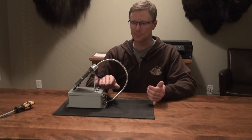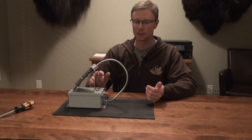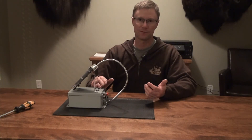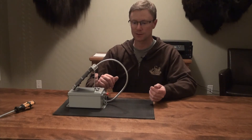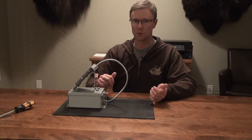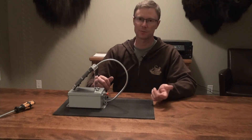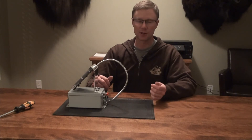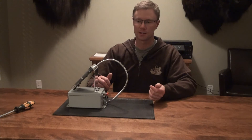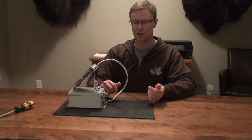In this homemade setup, I always set the battery and the solar panel facing due south in a sunny spot, and then set the camera up where I want it. You can set the solar chargers up within five to ten feet of the actual camera — five feet is more than enough in 99.9% of cases. Rarely have I seen a situation where you'd need to go more than that. The connections from the trail cameras to the solar panels — you can either buy the wiring package or sometimes they come with the cameras from the factory.